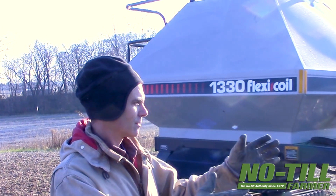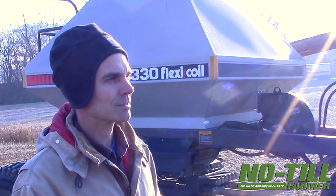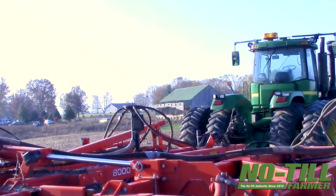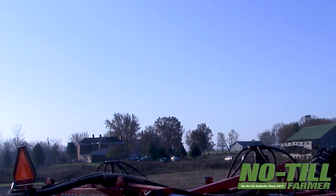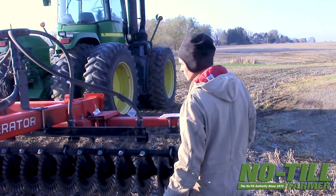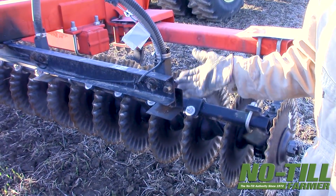This tool is designed to go behind a cultivator, so it wasn't too difficult to mate it up to this tool — we just had to figure out the hosing. The piping was more of the challenge, and if you look, we've got some towers. These hoses blow up into towers and we're using three towers. We've got the spacing on 25 inches and built some brackets up front here. It'd work either way if you threw the seed down in front of the gangs or here — we decided to just give it a shot at the middle.